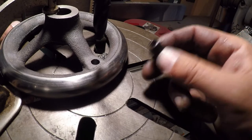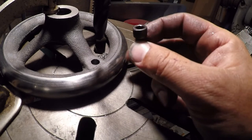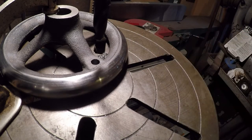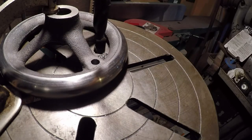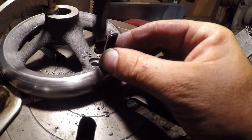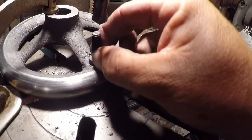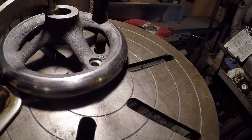Like I said, I don't have any counter bores, but I don't really think this is super critical — we're just trying to hold a crank handle on. This is 15/32nds which is just a clearance for that. So we're going to kind of peck at it a little bit and check when the head sits more or less flush in there, and then we're going to call that good. I was able to chuck up just a little bit higher on the drill bit so now I can stick this guy down in there and check it.